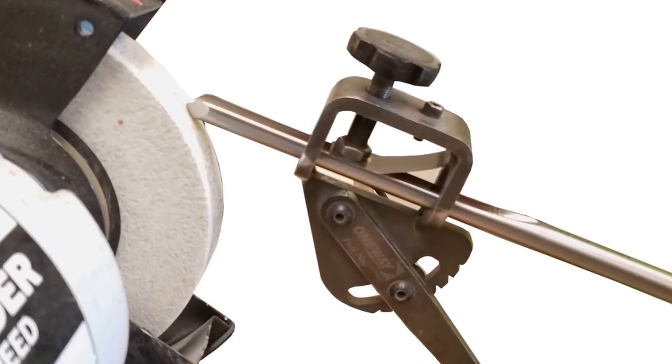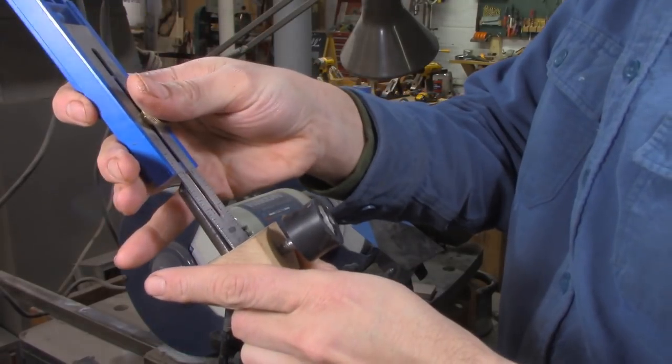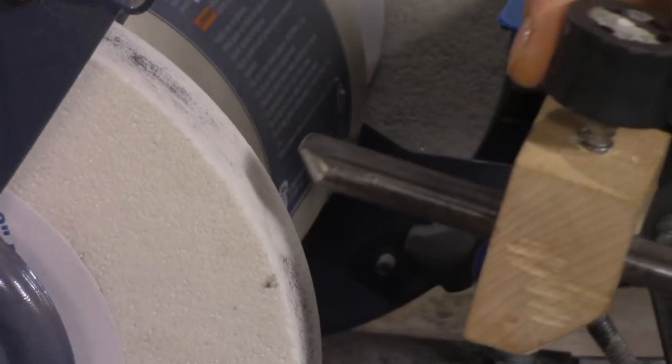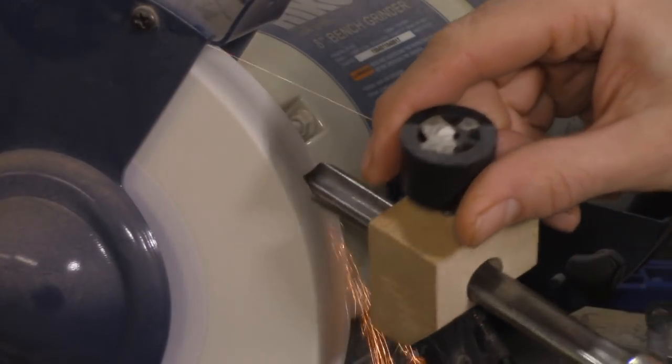Exactly how to shape that fingernail grind is beyond the scope of this video, but I'll link to something in the description. You get your basic geometry freehand, and then for grinding and sharpening while you're turning, you typically set it up in a jig like this one. This is the Wolverine version, which you can buy — it works really well. If you don't feel like shelling out the money for the Wolverine, lots of turners make their own jig. When I'm sharpening my gouge, I put it in one of these little homemade holders, get the geometry set up correctly, put the end of the holder in the arm part of the jig, set the tool against the wheel, and just sweep it back and forth very lightly a couple of times. The combination of the arm and the jig preserves the geometry and takes off the minimum amount of metal each time I sharpen. A couple of quick passes and I'm ready to turn.